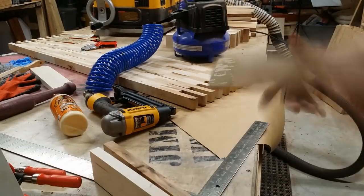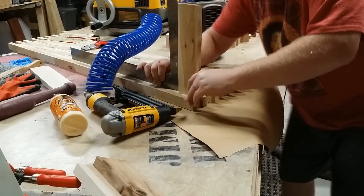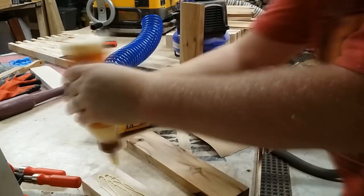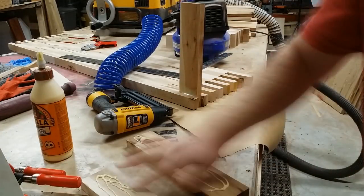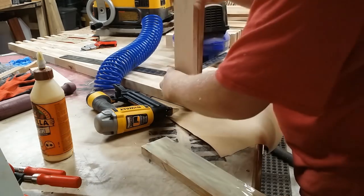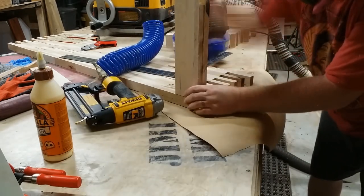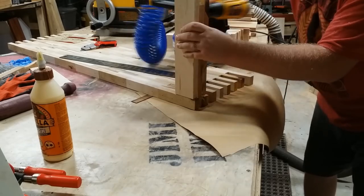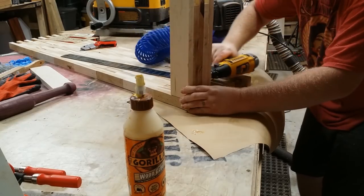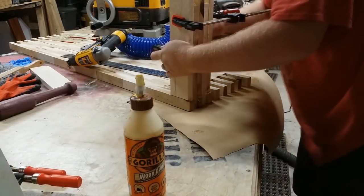So here's the second glue-up, and everything I learned from the last time I'm going to strategize and utilize here. I put one down in the finger joints and these ones go on the finger joints. I'm going to go 5 thick here. So here's three pieces — I'm going to add another one down into the finger joint, then another one on the finger joint, brad it in place, and then clamp. The way I finished the rest of this project was I would put one in and one on, brad them down, and then clamp it. And this was the best way I could get it through the process.